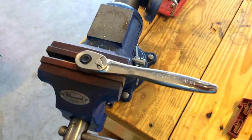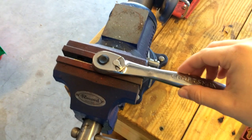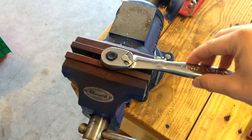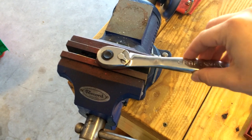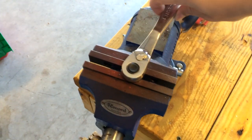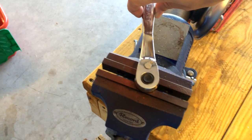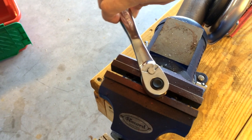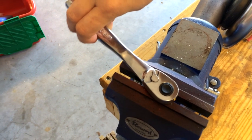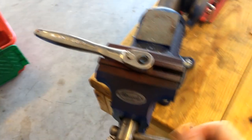What I'm going to do is put this on the vise and see the difference between these two wrenches. I put the professional on the vise and I'm going to count the ball bearing ticks between an arc. They have about this much play — a few degrees. Going to 90 degrees, I count: 1, 2, 3, 4, 5, 6, 7, 8, 9, 10, 11, 12, 13, 14, 15 — until I get to 90 degrees. So that was 15 ticks to get to 90 degrees.